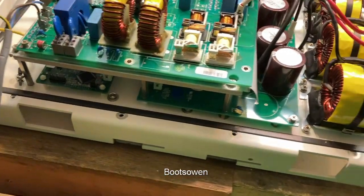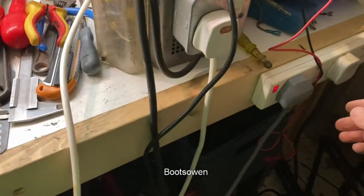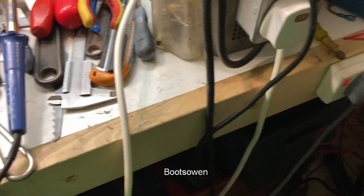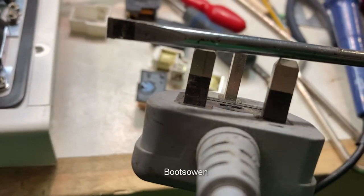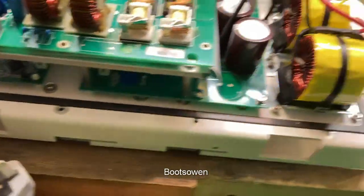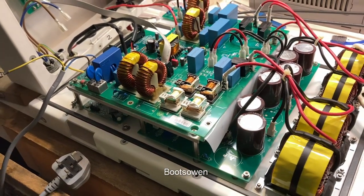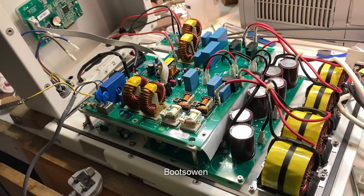It's still just chugging away at 44 watts. If I turn that off, turn it down - that's my DC turned down - and plug out, the relays are just opening there, all four of them together. If I then unplug the DC and then the AC... I was getting an arc across that on some inverters but not on this one right now. I think some of them have a capacitor across live and neutral acting as some kind of radio frequency interference suppressor, which was giving a little spark. I realized that the first time a few days ago when I zapped my finger.